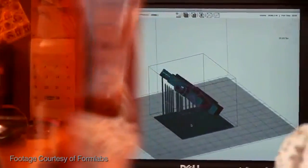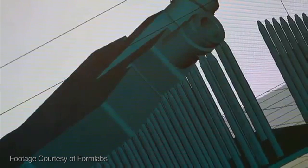So how do you focus and steer the laser? There's some clever things we've done to make it extra reliable. The whole point of what we're doing is making a machine that's a professional technology, affordable for professional product designers and engineers who may be individuals and don't have access to the resources that a huge company would. We can do stuff with much bigger overhangs partially because of the process, but also because we've written our own entire software package. You can import a model, it can detect where there are overhangs, and generate smart support structures. When you print, the part comes off on a little pin bed — you can just snap it off, and it feels like you're peeling it off a piece of velcro.